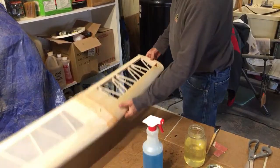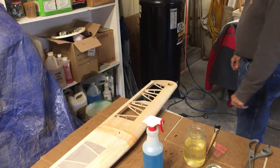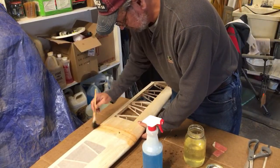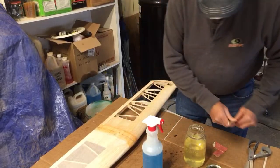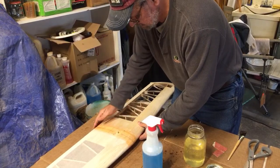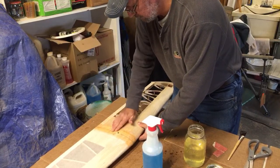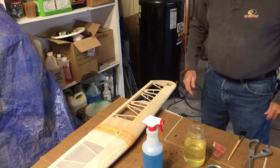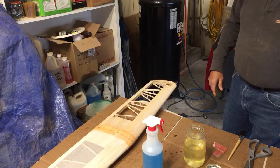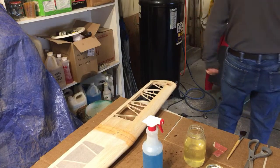This right here is the Geesky Nobler wing. Not a kit. It's got a set of plans. It's been modernized, just like my Tucker has a geodesic wing, has a foam leading edge, just like the Tucker. It's the way to do it. We're trying to get rid of the starved horse look, where your leading edge sheeting dips in between every rib, and you can't get away from it with a ribbed wing, period. Looks like an I-beam wing, only not quite as bad.